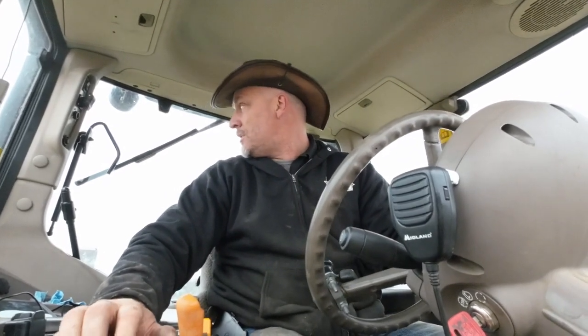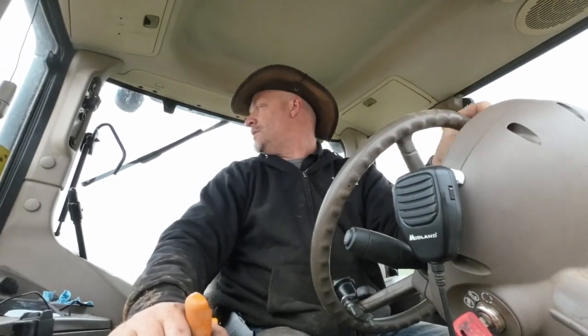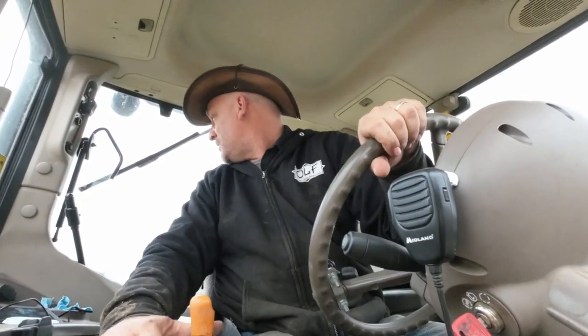But yeah, we had a breakdown. Just a little one. On the axles for the opener, obviously there's a nut that holds the hub on, and the nut that holds it all on stripped out. So it packed with dirt behind the gauge wheel and up against the gauge wheel and the disc, and then it stopped turning, and I was taking on corn stalks. But the bearings were not bad, and unfortunately I didn't have another nut.